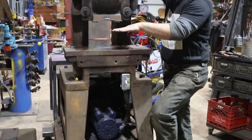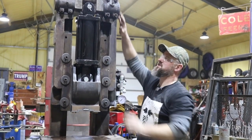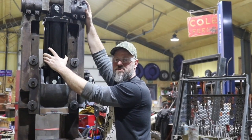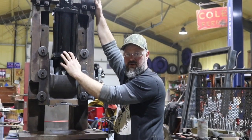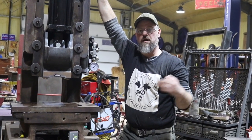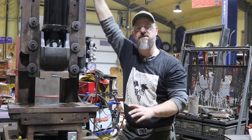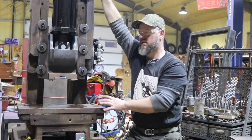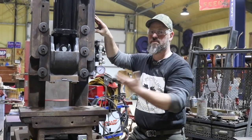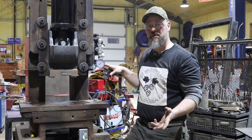I removed the center column — a screw that adjusts the distance the piece would move down — and it articulates off of this knuckle. The knuckle has been preserved because it's a big piece of metal with a natural mounting place, and I mounted a five-inch bore, eight-inch stroke hydraulic cylinder. I got the ideas from online research and a couple of books on hydraulic forging presses, then took a synthesis of that data to retrofit this machine, which has a very robustly built ram and ways.